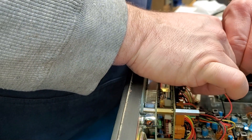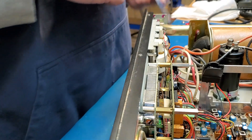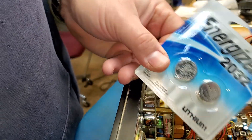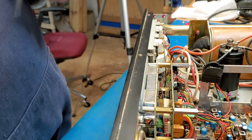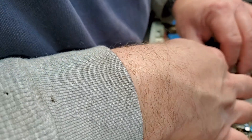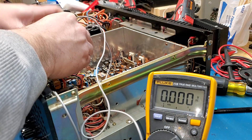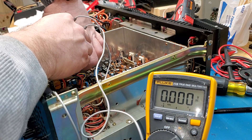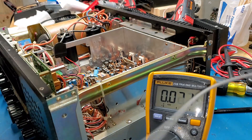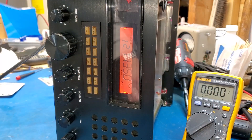Now there's the battery compartment — open it up and stick a battery in it. I've got these Energizer 2032s and they have a little tape on the bottom; don't forget to take that off. Slide her into place — look at that, that's sweet. We got nothing at first, so that little switch on the back must have been off. Flipped it on and got 3.27 volts — perfect. Let's plug the radio in and see what we get.